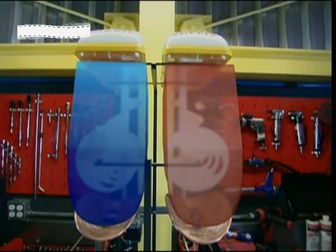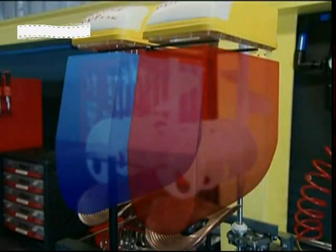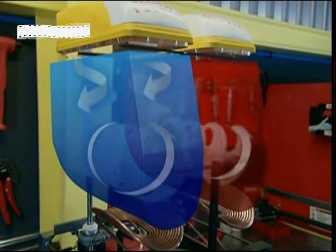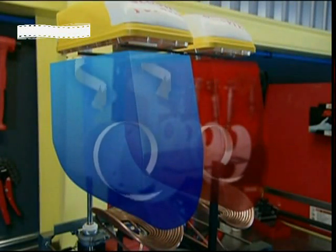It's so cold it absorbs the heat in the solution and cools it to minus 3 degrees Celsius. But below zero, water molecules in the solution should change to solid form — they should cluster together to form ice crystals. Two things prevent that from happening: one is the antifreeze in the solution, and the other is the continuous movement of the mixers.